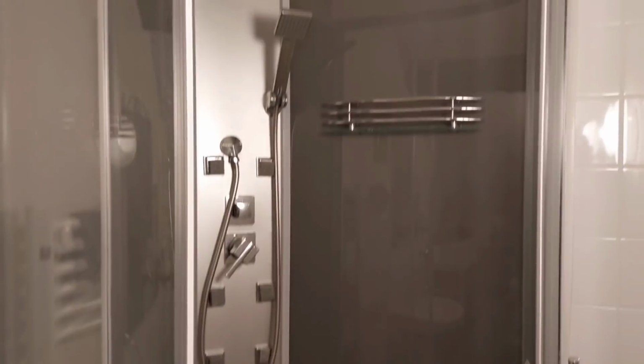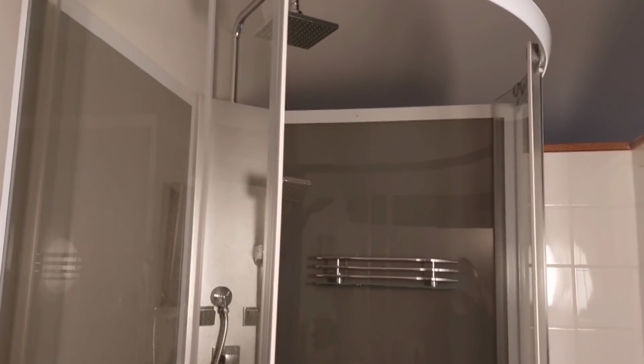So that's done, and then I've done a fresh bead of sealant all the way up here, just to seal it against the wall. It's been screwed in back against the back there, and then this water strip, which has been an addition. I didn't put it in, but I put it back just down there. So we just need to leave that now for 24 hours, and then we can have a shower back in here. So that's one down.